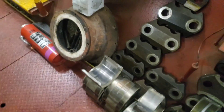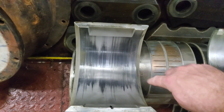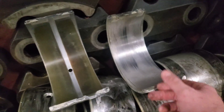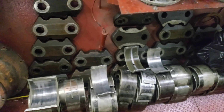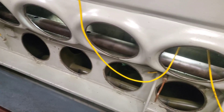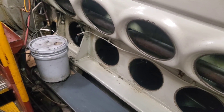Here are some connecting rod caps — we flipped a few over to show the different types of fork or blade assemblies. So that's 30,000 hours of wear. They're not terrible — I mean, the engine wasn't knocking or losing oil pressure, it was running fine — but it's definitely time to change them. The lower shells, like all the mains and a lot of the connecting rod shells, are original. They actually get saved — all the force and power is on the top of the connecting rod and the bottom just doesn't wear out.